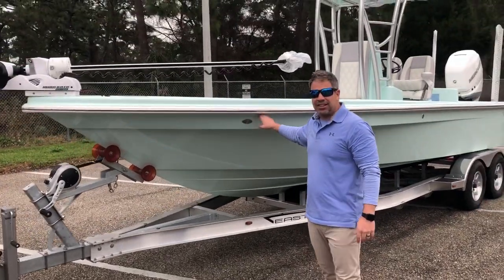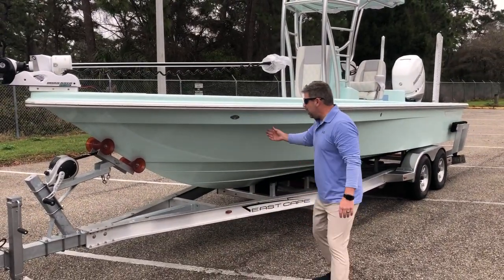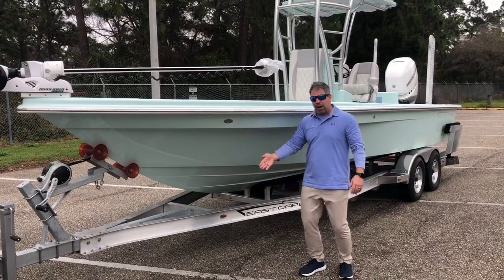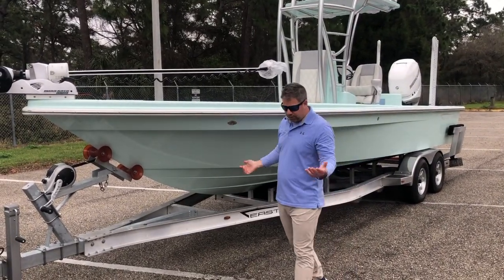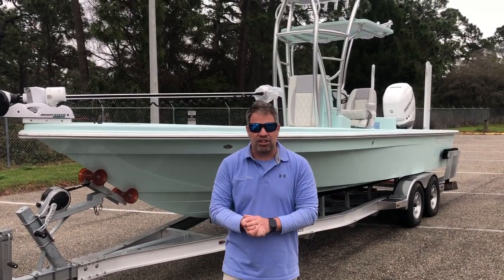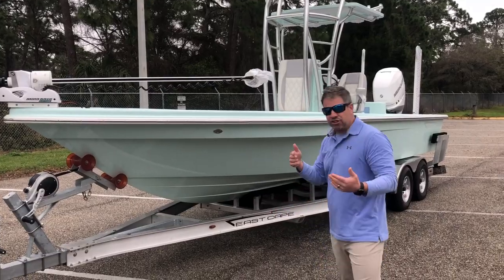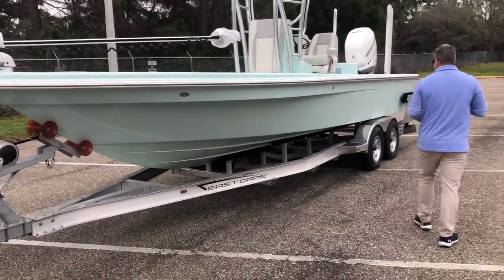This is proven — it's not anything new. We've been doing this since 2007 on our Cayman model, but this is a bigger spray rail that goes up a little more than our skiffs. So when he's off the beach fishing for tarpon and things like that, he's not going to hear that pop sound you would traditionally hear. He also has your traditional bottom for lifting strakes.